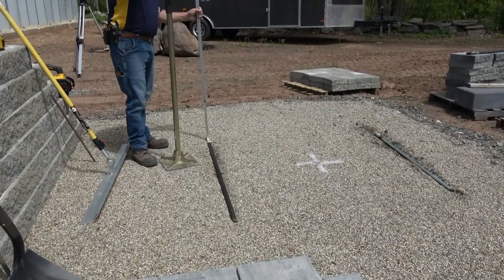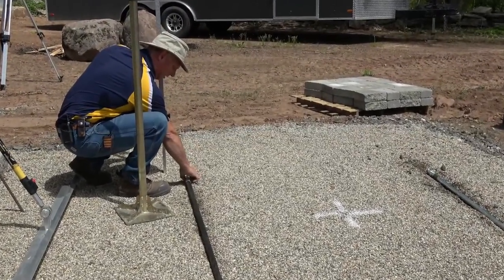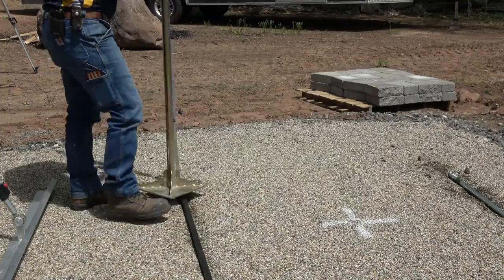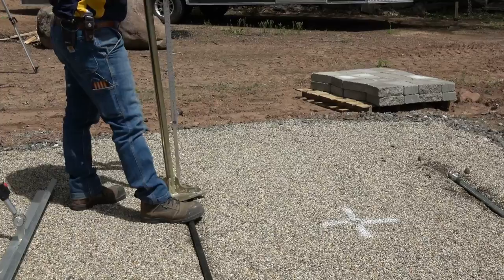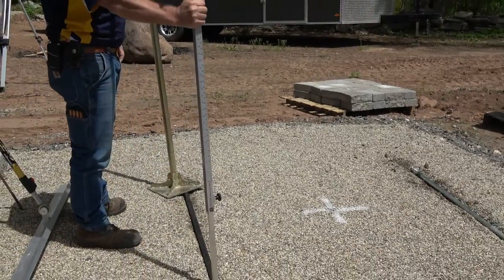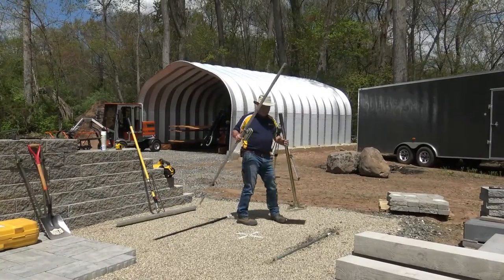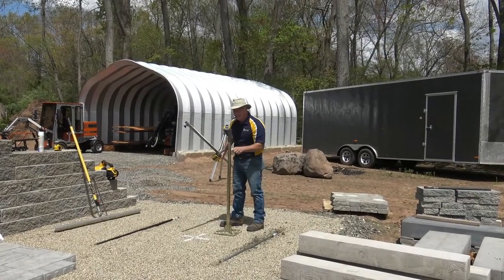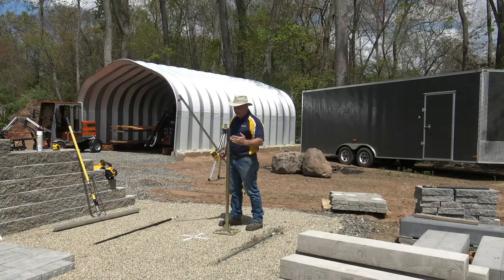So because of the slope on this patio, this one's a little bit low, which is fine. I'm just gonna simply add a little of my bedding layer to make it high. And now, I tamp it. This pipe's set dead level. Now maybe just to explain a little bit, this is gonna eliminate me down on my hands and knees with a level and trying to get this exact. If I'm setting this with pipes, I know for a fact once I screed it again, my base will be dead level.